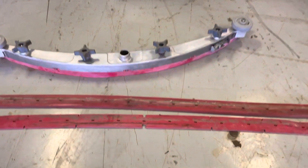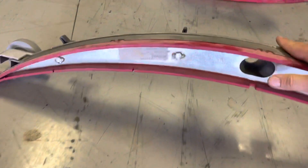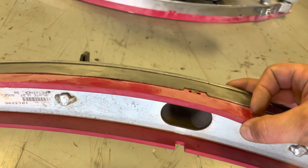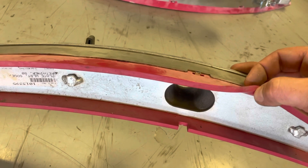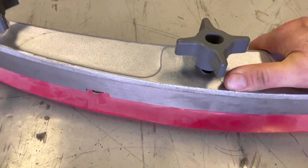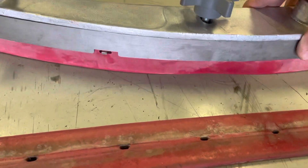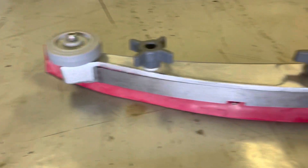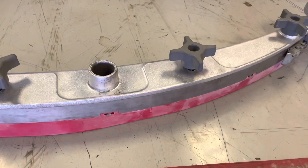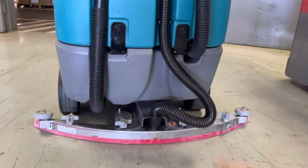If we're talking about squeegee performance, it's very important that the rear squeegee blade always be making contact with the ground with a square edge. The square edge is what really scrapes the water along. When you couple that with just a moderate amount of deflection — not mashed all the way down, not standing up and just fluttering on edge, a little bit of deflection flat across the arc — a square edge is really going to pull trash and water along and keep good suction and vacuum up to the recovery hose that creates your lift up into the tank.